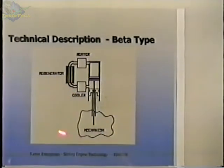This engine type is what I have here. This is my engine type. I like it. It's a fairly compact design, and it also has some other advantages in that dead volume, which is volumes of gas that are not swept by the pistons, is minimized, and this helps to increase the compression ratio.